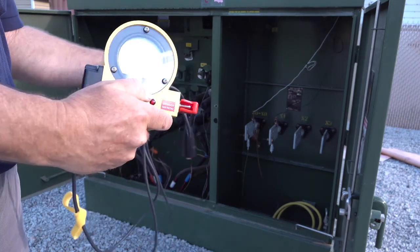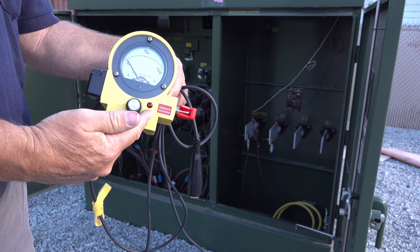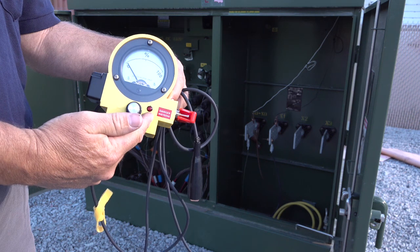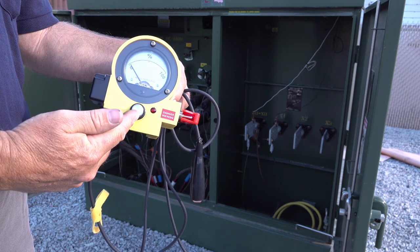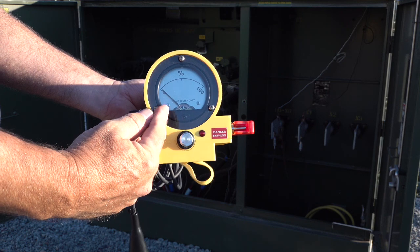On the face of the tool is where the tool-energized red LED light is located. This gives the user a secondary visual indication if the tool is in the on or off position. The LiveLine tool fitting is where the user will attach an adapter for their preferred stick attachment. Notice the meter scale goes from 0 to 100%. A 0 or near 0 display would represent a cable that is able to maintain an 8 kV charge. A 100% or near 100% would represent a cable that has a bolted fault or has extremely low impedance, caused by the cable being extremely long or degraded from age.